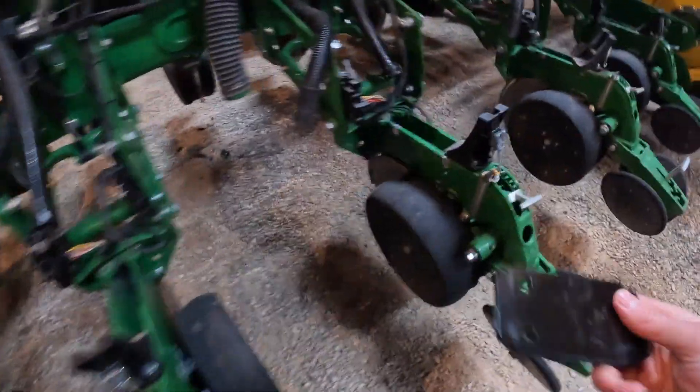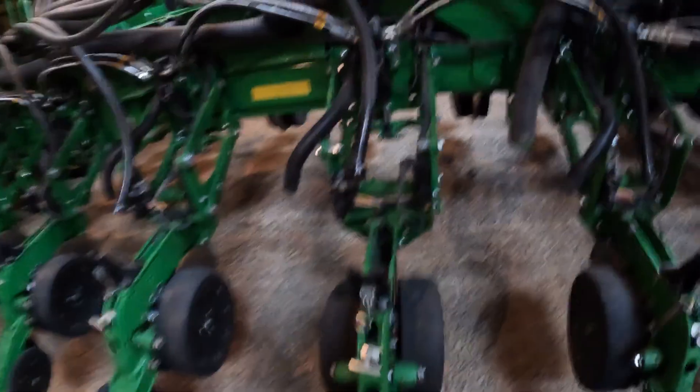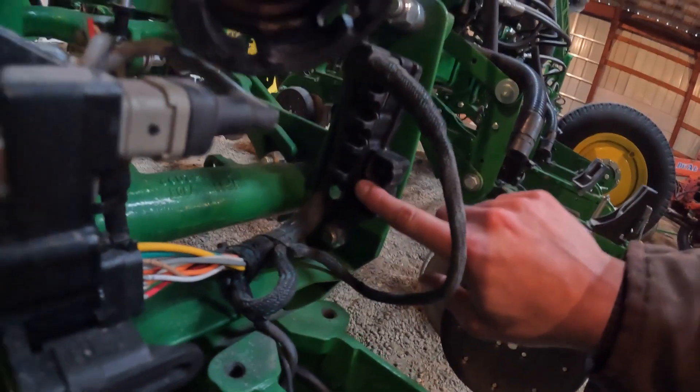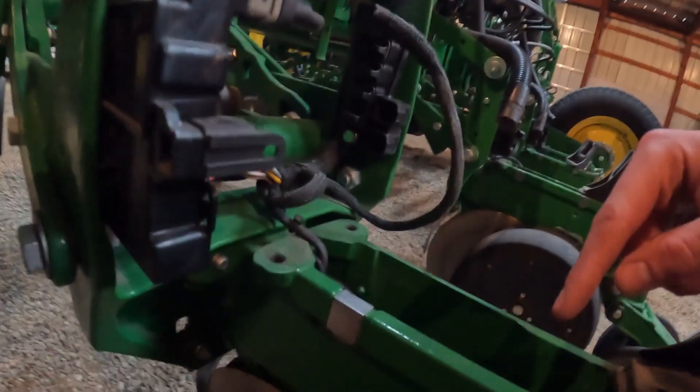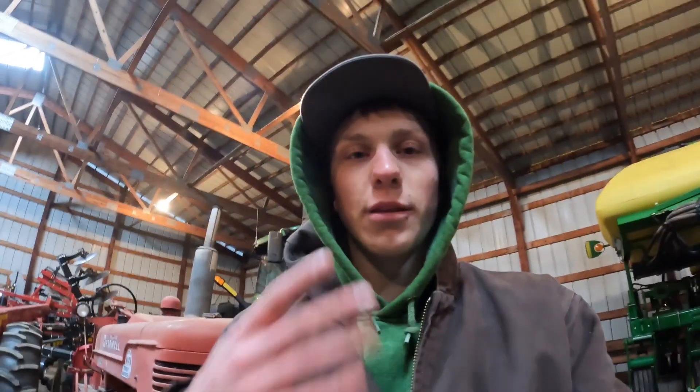To add the Speed Tube, the first thing I'm doing on the planter is adding these little steel shims - currently there are plastic ones but they're not long enough, so I gotta add these. The boss man's adding these called expansion hubs. Basically, normally we just have one thing getting run off the SRM - the module controlling each individual row unit - but now since we're gonna be controlling the meter and the Speed Tube we need multiple outputs. Think of it like an electrical power strip: power comes in and each one will be a power out. We'll use one for our meter, one for our Speed Tube, and then if we ever add Furrow Force or Smart Depth the planter will have those other outlets.